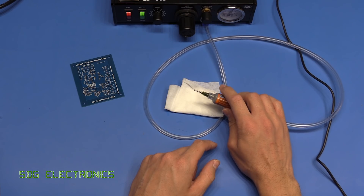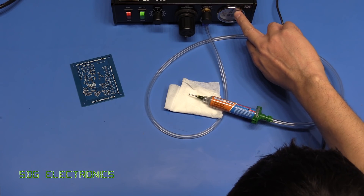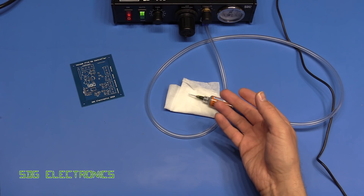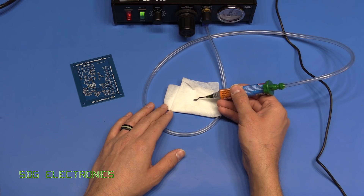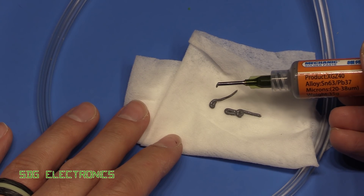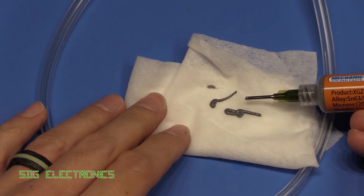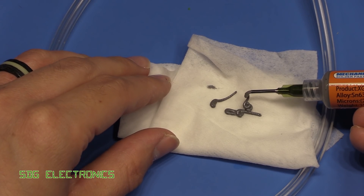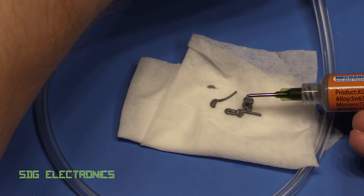I've just attached the syringe of Mechanic solder paste. It's still a little cold so it's quite viscous. I've set the air pressure to almost 90 psi — relatively high — and it's set to manual so it works for as long as I press the pedal. Let's see if we can dispense anything. Okay, that seems to dispense quite well. Let's see what happens if we turn on the vacuum — you can just see it retracts back very slightly, it's not massively dramatic.